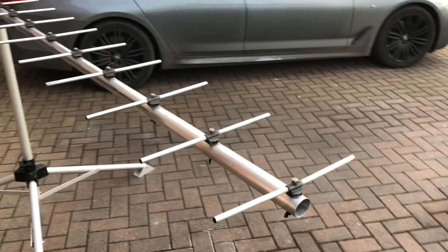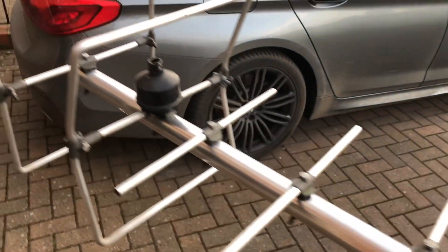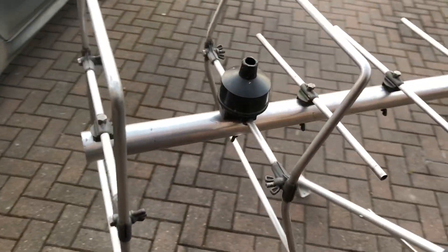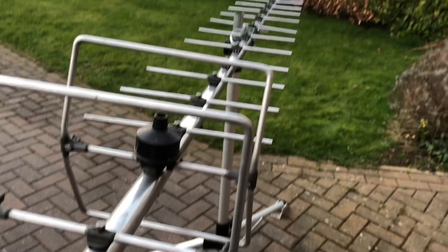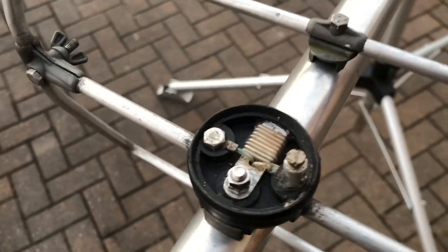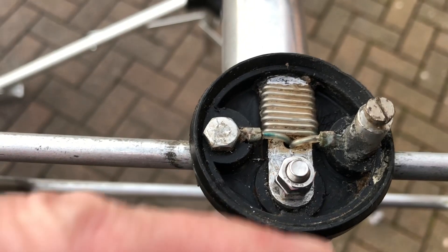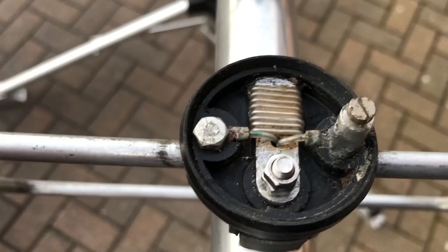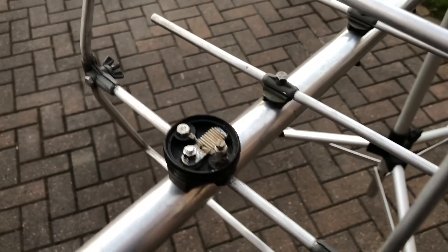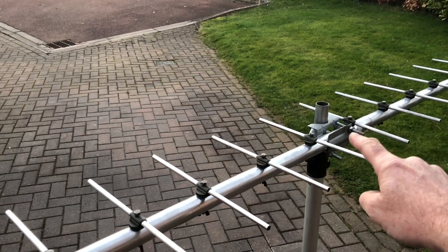Here's the beam temporarily set up so we can work on it, and you can see it's all in good condition. Down this end we have the square dipole and reflector — 18 elements in total. This is the connection that I've cleaned up, put new bolts in, and removed all the sealant. You can see the matching circuit to get 50 ohms — braid attaches here and center goes there. The coax comes out the top, and from a photo I've seen online from many years back, it goes up, loops down onto the beam itself and then down the mast.